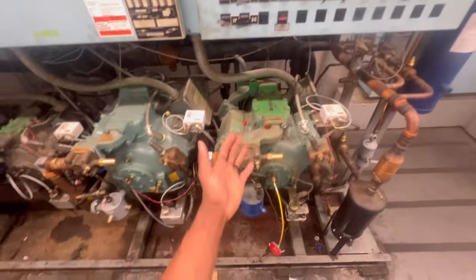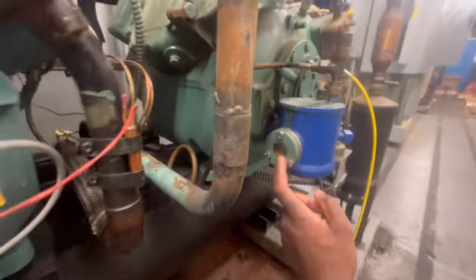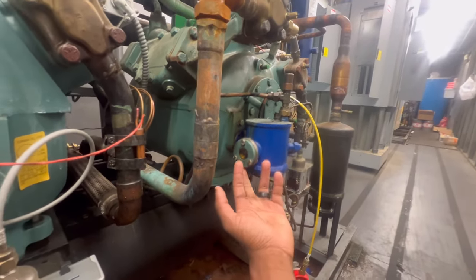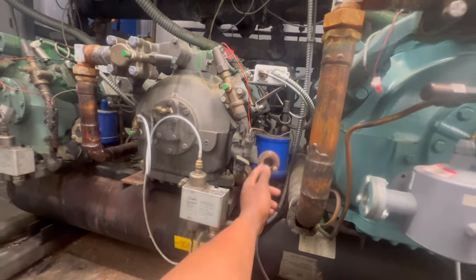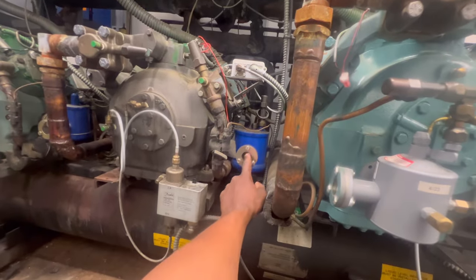Next I would like to go to the compressor that is off on oil, or in oil lockout. I like to check the oil pot level - as you can see we got three-eighths, which is pretty darn good. If we were super low then I would have been concerned. Same with this one - this is full, though. We should not have that much oil. Too much oil is not good; it should be midway. Maybe I can adjust the oil pot, but we'll see.